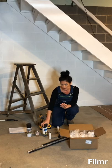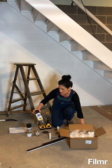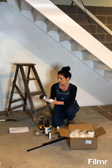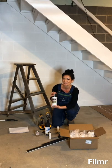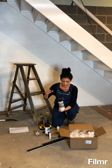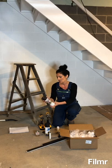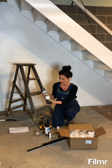I intend to make them look like the black pipe. So first I'm gonna spray paint them with this cheaper, regular Rust-Oleum, and then give them a final coat. I'm gonna get hammered today. Well, maybe on the fumes, but this is hammered Rust-Oleum. If you've never used this, this stuff is awesome. You can spray paint plastic junk and it looks like something spectacular. I bought just black, hammered. When you're done, it has a finish that is very similar to the black pipe.